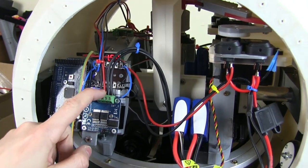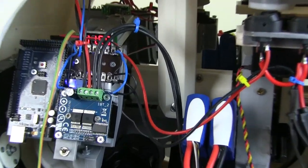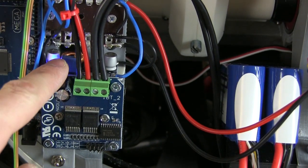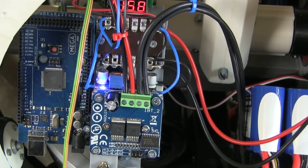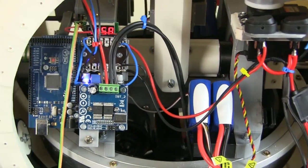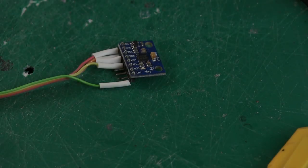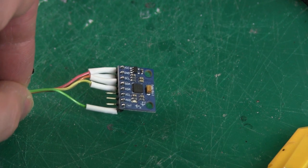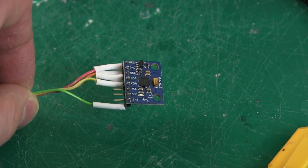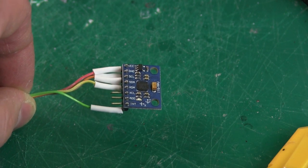On this side again, the motor driver gets 24 volts from the other side. There's also a five-volt regulator in there — the thing tucked away with the blue light on — wired to both sides of the terminal strip. That will power the Arduino, the IMU, any LEDs in the ball, and so on. The last thing before programming is wiring power to the Arduino and wiring in those enable switches. I'm wiring in the MPU6050 inertial measurement unit. I've wired VCC and ground — this one is five-volt tolerant with an onboard regulator. The SCL and SDA are the I2C pins going to the Arduino, and the interrupt pin signals when there's data in the buffer.